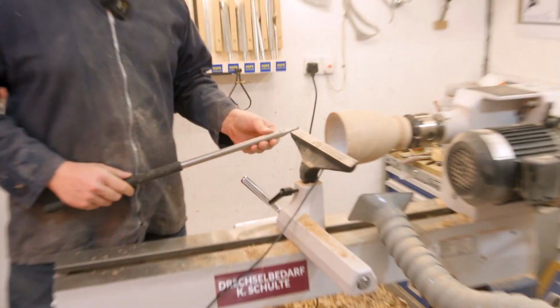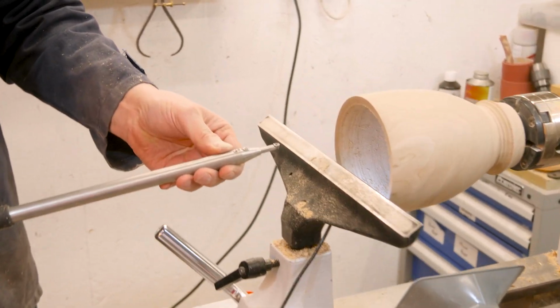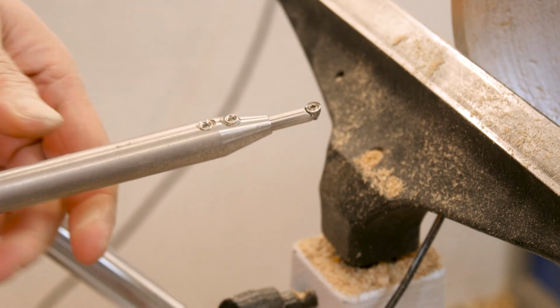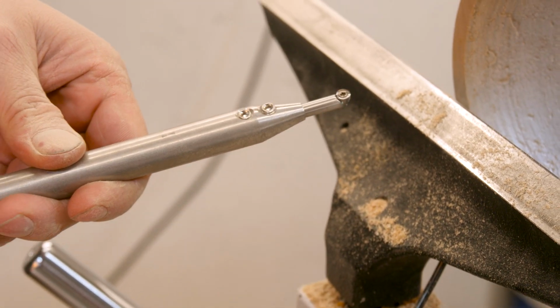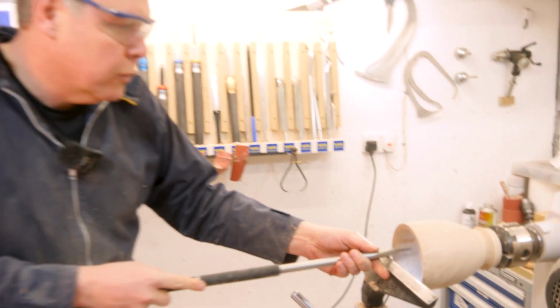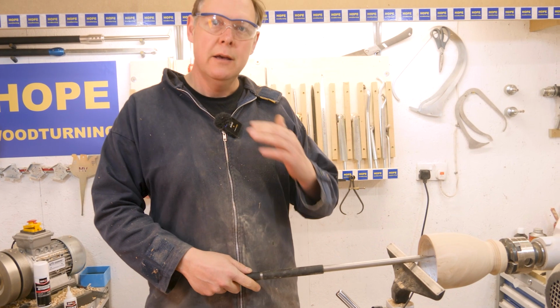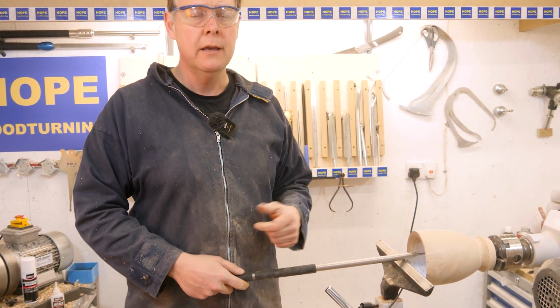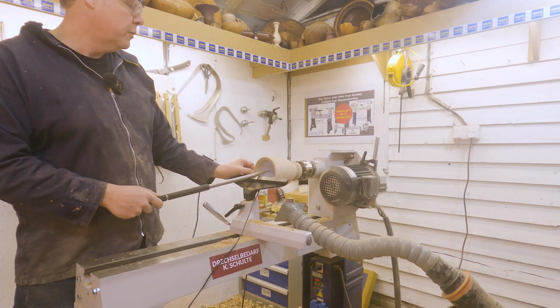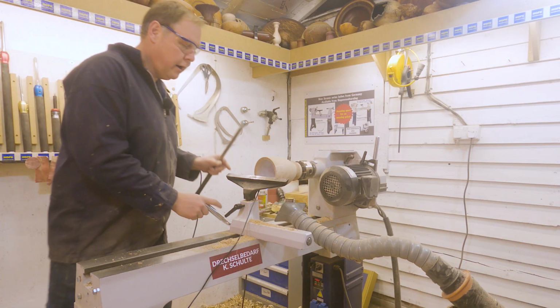I will start again with the 6mm Pro carbide tool. It's really a great tool for just getting material out very, very quickly. So it takes a lot of practice to get a nice smooth finish. So we'll try and get the best finish we can, but I'll most likely finish with my vase negative rake scraper, which will just smooth everything out. So we'll go ahead and reduce that by half.